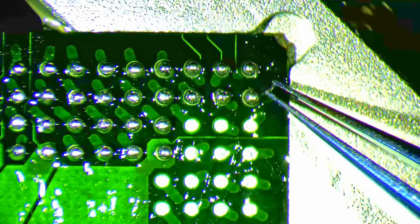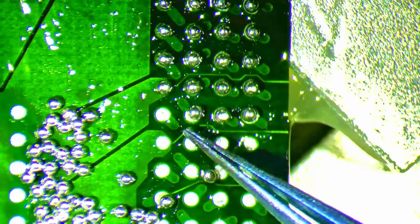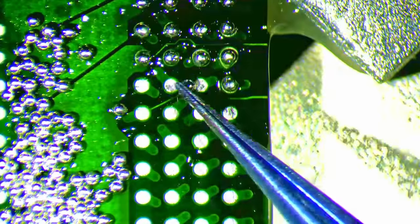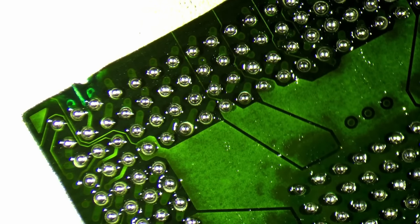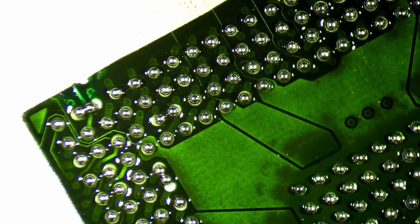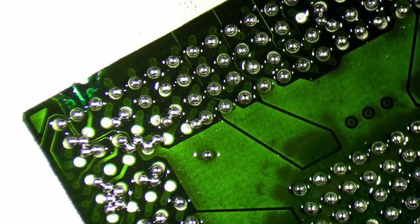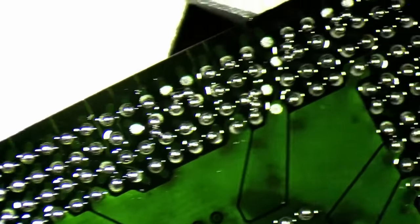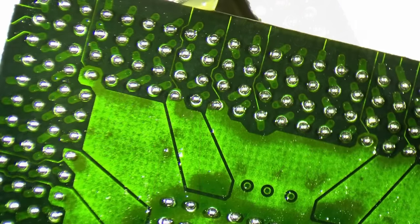Next, we have to reball the chip. You have probably seen people using a stencil to get those balls back on the chip. Unfortunately, I do not have a suitable stencil and I was stuck manually aligning the countless solder balls, which are 0.6mm in diameter. After 20 minutes, I was happy that every ball was in place and I hit the chip with hot air at the lowest airflow. And much to my dismay, I had to watch all the solder balls floating around and migrating towards each other. So what did I do wrong? Well, I had too much flux on my chip. There was really no reason for me to continue — all I could do was start over, but this time with a lot less flux.